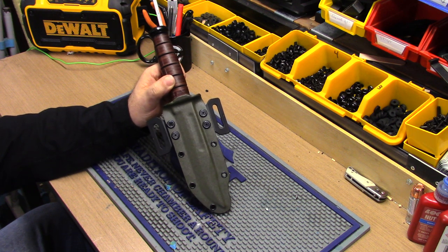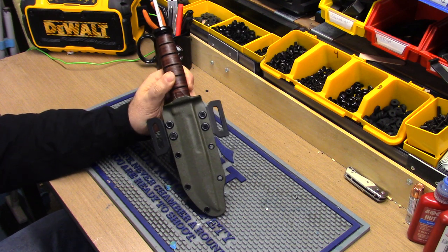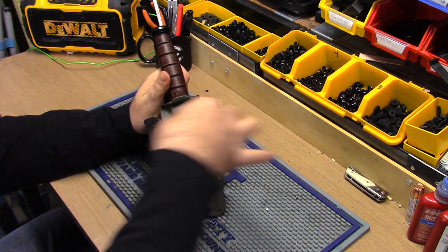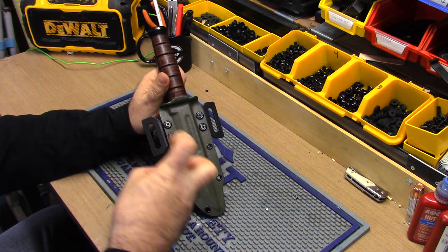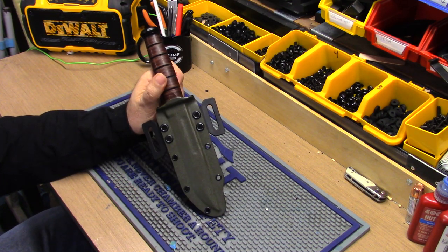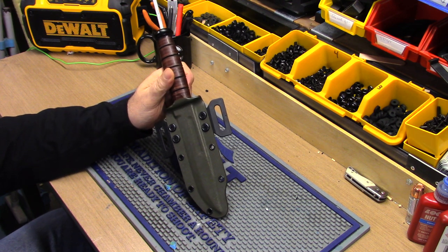The Bolteron, I think, can take more heat, because when I'm sanding and polishing it, it doesn't melt. When I sand and polish regular Kydex, it melts right on the sander — it turns to goo and you have to pick it off and burn your finger. But the Bolteron doesn't really melt; it gets soft and then immediately gets hard again, like a crust you can just pick off. That's what I think Bolteron has over Kydex.